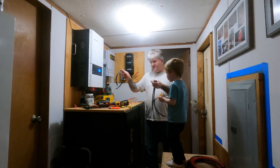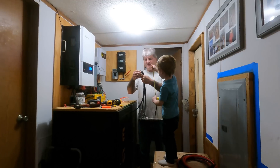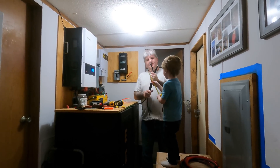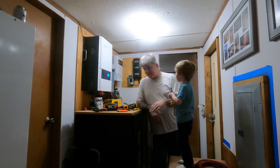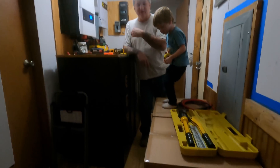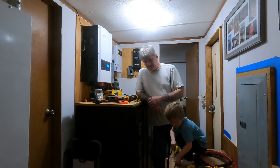I've got the jumpers from battery to battery to do a 48 volt series connection right there. This is two gauge wire. Like I said, this will make 18 batteries — 18 24-volt batteries. There's six in each cabinet. There's six more right here on the floor going into that new cabinet. We'll show more about it as we put it together.